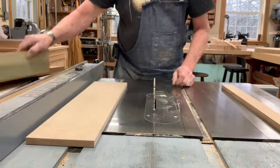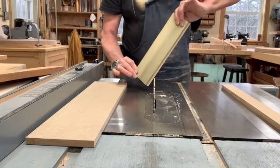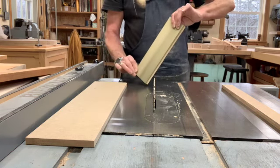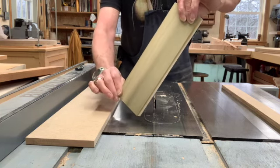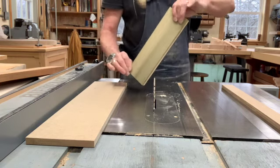You see, it really doesn't matter if you orient the piece this way to that blade. If you can hold it perfectly rigid and guide it in a path parallel to the plane of rotation, you could make that cut. The trick is it has to remain traveling in that direction — parallel to the plane of rotation.